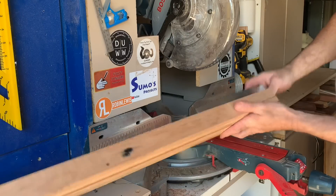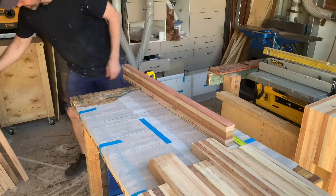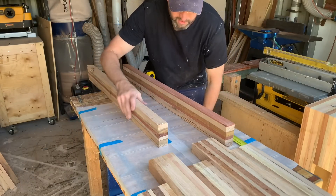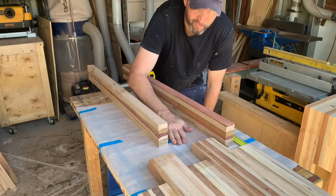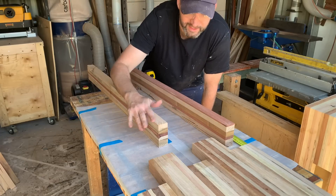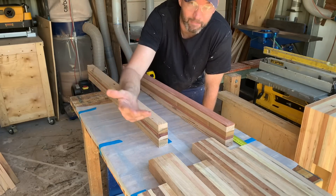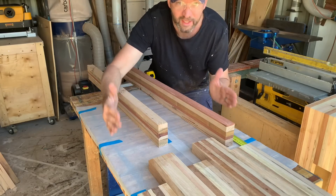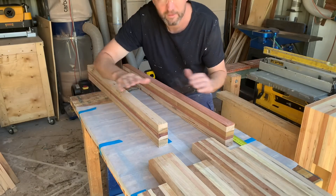First of many checked squares — really important for a good glue-up. For this one I'm just going to use my workbench because I know it's nice and flat. I've got some greaseproof paper laid down so the glue squeezes out, I can lift it off and clean up both sides. Use the bench to clamp it all down and get it nice and square.